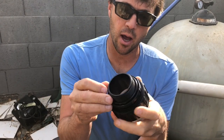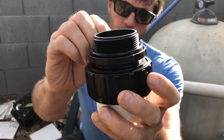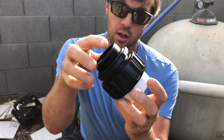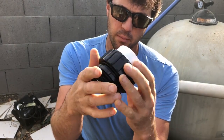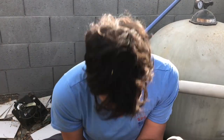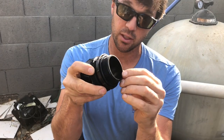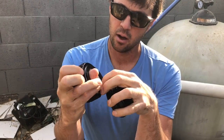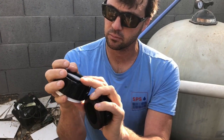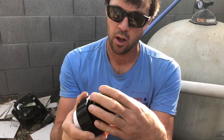They've got a couple of cool things going on here. Not only do you have the threads that you can seal up and screw down, but they've also got this O-ring right here — so you get double the seal. If this ever gets hot, shrinks, or changes, that O-ring takes up the slack making that nice seal on the pump. Also, if this union ever has any issues, I can unscrew this and replace just this part, or replace the O-ring really easily. Plus the seal here is totally replaceable. They just make a really cool part that makes life easier for pool guys, nicer for the homeowner, and saves money in the long run.